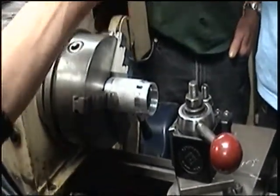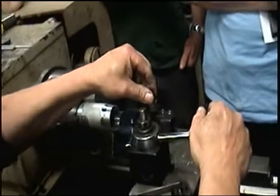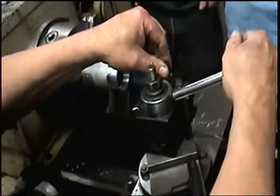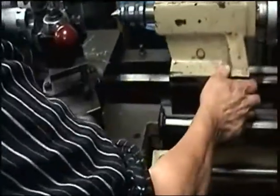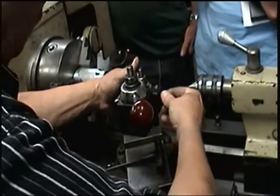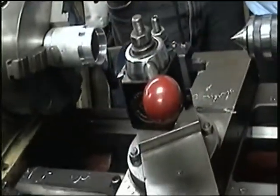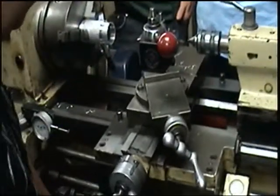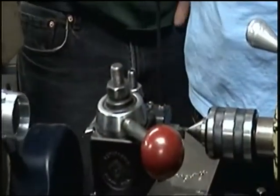The left-hand tool is going to go with the tool holder in the front position. I also want to remind everybody to open and close these — you will push the handle forward to open it, pull it to close it. Now I'm going to lock that down, see if that's locked. Put it on the back side of my tool holder, square with the tool post. I can sit and lock it down, advance the cross slide, and lower my tool as required.